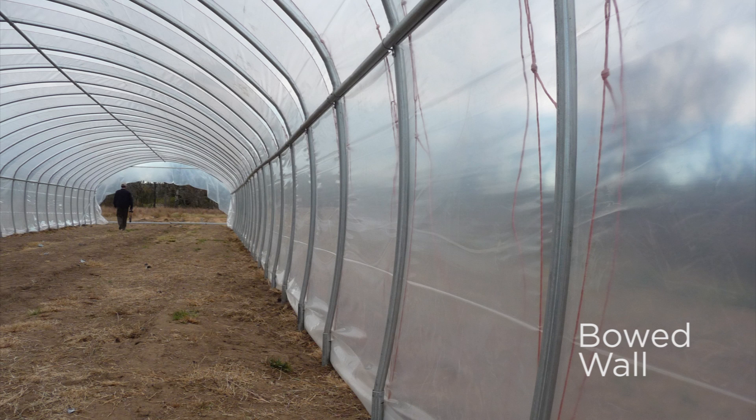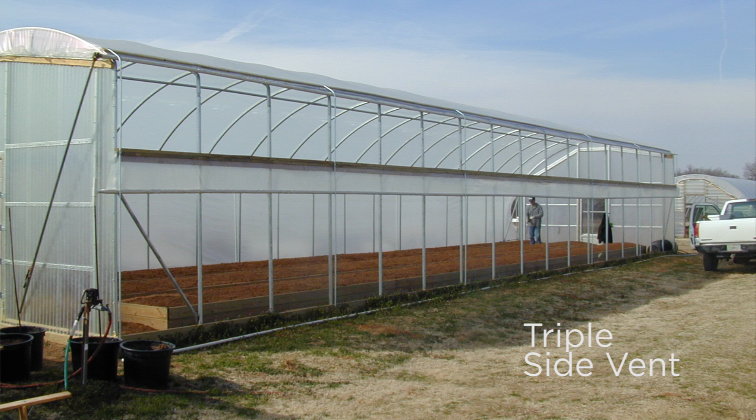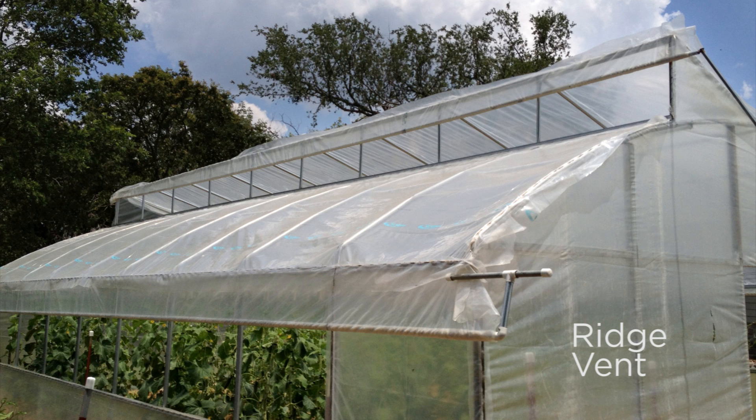You notice it bows out a little bit, about a foot. This is a 20-foot model. If you're looking for a way to dissipate heat, build them tall — I think Lewis talked about that. Build the houses high and then utilize that flue effect. This is on the leeward side. You always want to put that third vent on the leeward side if you make a triple vent house. Let the wind blow in from the opposite side of the house and ventilate it.